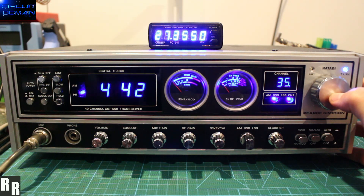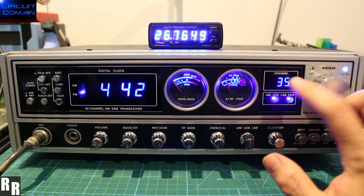Four button press. This is that cool feature we've been talking about with this update — the 5KC, which my PLL adapter boards support, or any PLL for that matter. So, UPD-858, PLL-028, which is coming soon. And with my PLL adapter board, any of the 2824 or 8719 radios will now support 5KC. So, 1, 2, 3, 4 — 5KC.